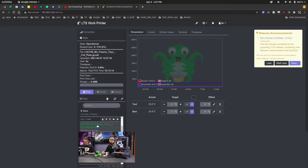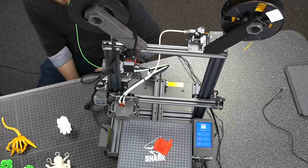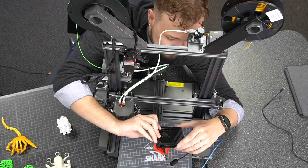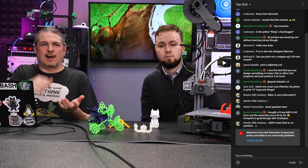If I click on a file it loads but won't start printing until you hit the print button. OctoPrint has a portion dedicated to a webcam stream so you can hook up a camera to the Raspberry Pi and monitor prints remotely. It also has a G-code visualizer. This is running on a Pi 3; my home one is a Pi 4, but I honestly haven't seen much performance difference — the G-code is so simple.